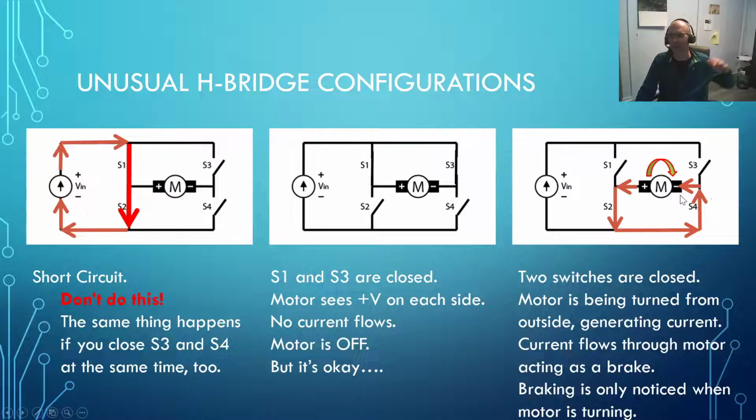When electric cars coast to a stop, you take your foot off the gas, okay, or they still call it putting your foot on the gas when it's an electric car. You take your foot off the pedal, and as the car rolls to a stop, the kinetic energy stored in your vehicle going forward keeps turning the axle shaft, thankfully, which turns the motor, which generates electricity, and thanks to the switchgear in your motor, runs that electricity back into your battery, so that after you've coasted down a hill or coasted to a stop, you can reuse the portion of the energy that you were able to capture to get going again.